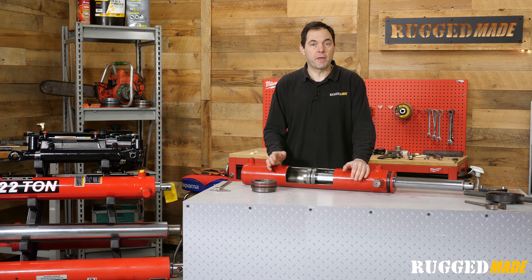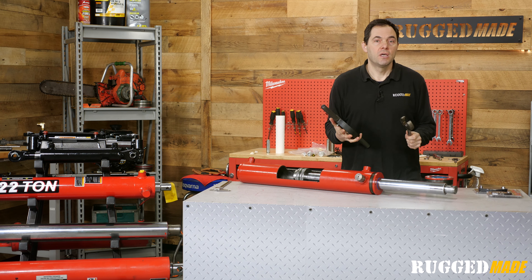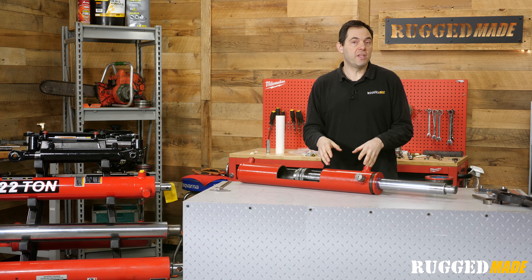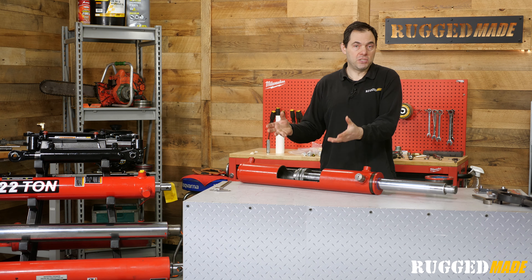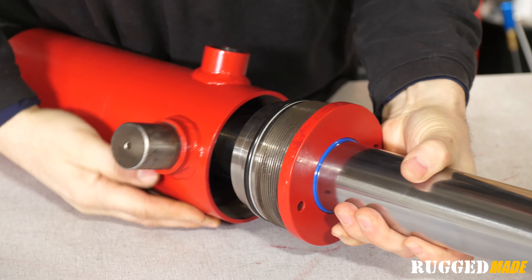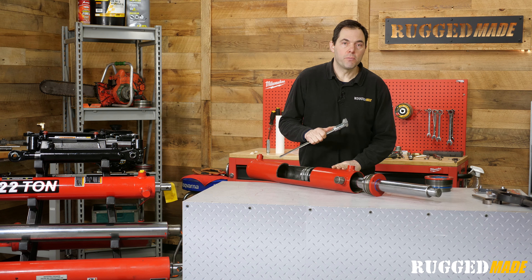Best practice is to disassemble the cylinder. Don't attempt to disassemble a cylinder unless it's been completely disconnected from the hydraulic system and drained of oil. Now we're going to remove this gland from this threaded cylinder. Threaded glands on welded cylinders typically require a special wrench. The threads are often secured with thread lock or another type of sealant, so you may need to apply some heat — keep in mind that heat could damage the seals. You will need to secure the cylinder due to the force required to unscrew these glands. Sometimes the best way is to leave the base end pinned in place on the piece of equipment, which will give you the leverage that you need. Once you've loosened the gland, you can gently pull it out. Keep in mind some residual oil will probably drain out and make a mess. Then use your caliper to measure the ID of the barrel.